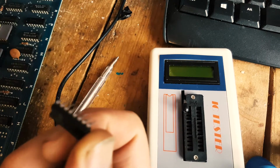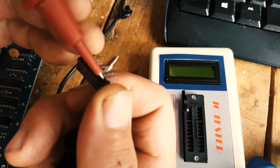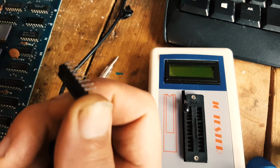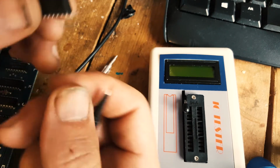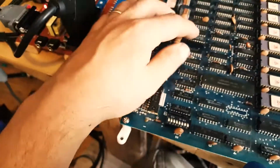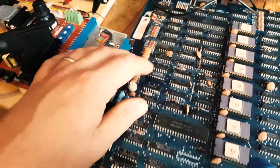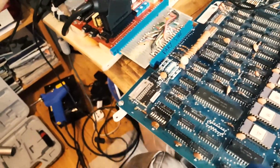Oh, I can't remember. Oh, I need to switch this on. There you go. So that's pin 12, which is the input, and pin 8, which is ground, were shorted, so I was sending 0 all the time, forcing the character to go right. So obviously what I did, and it's one of two things, in general, it's the capacitor or the line buffer. So I removed the 368, I put a new one, and let's try this.